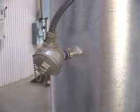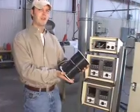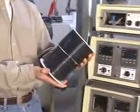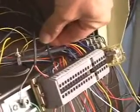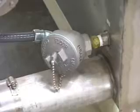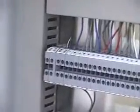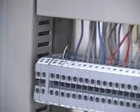The blue thermocouple located in the moist air line mentioned earlier needs to be connected using Type J thermocouple extension wire provided with each unit to the remote control unit. When working with thermocouples, the red wire is always negative. There is also a water temperature thermocouple pre-wired on the Humidaire unit that needs connection to the remote control terminals with thermocouple extension wire. Take care to keep both thermocouple extension wires away from power wires to avoid interference with the temperature signals.